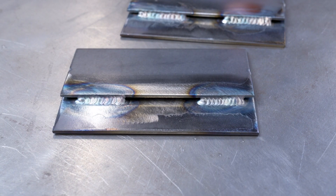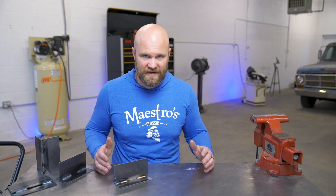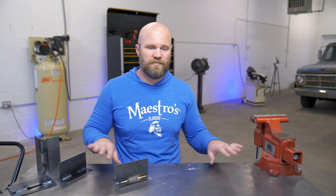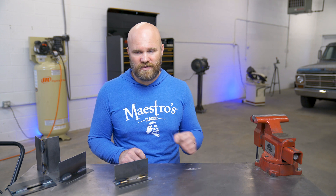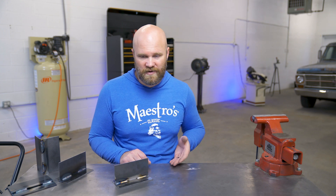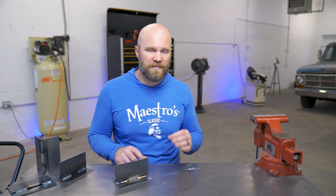For which one gives you better strength on this type of weld — I don't know, you'd have to do some testing for that. In my opinion, the 70S2 seemed to weld a lot nicer overall. The 70S6 does flow down a little bit more, which makes it more difficult in certain situations. I didn't particularly notice a big difference when welding over mill scale between the two. The S6 maybe had a slight advantage there, but definitely when going uphill or filling a gap, the S2's puddle locking together a little better makes it easier to weld.